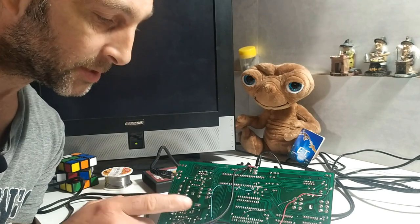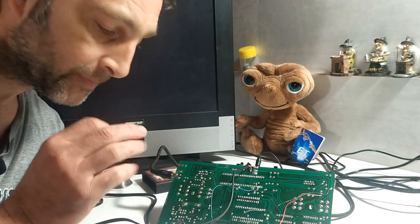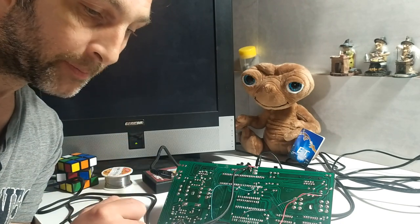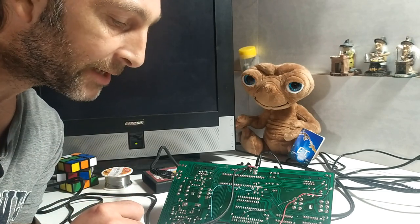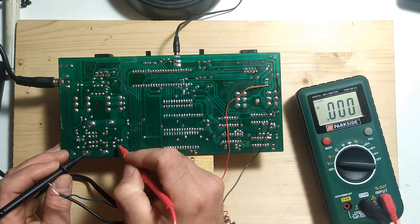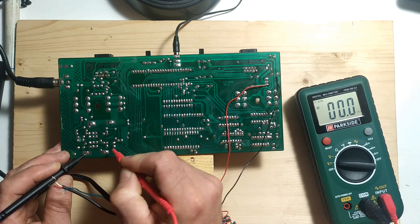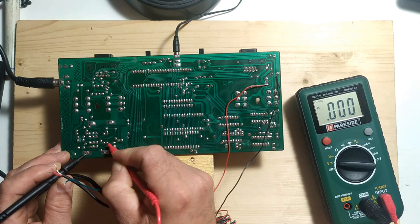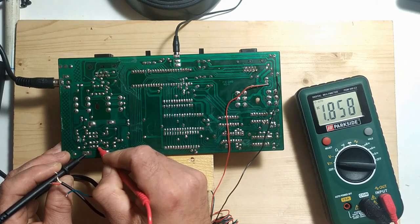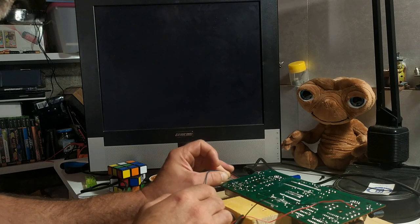Now all that was left to go from the TinyComp to the Atari was that little greenish blue turquoise wire that I had. And what I want to find for that is a composite signal, a weak composite signal that I can feed to the TinyComp to have it be amplified and fed out to the television. So the most logical place to look for a signal like that is down in the bottom left-hand corner here where we find the RF can. And I probed around with my multimeter looking for a low voltage signal that could potentially be a composite signal, and I found 3 points that were at 1.8 volt. Now, with everything turned on, the TV turned on, I just touched that bluish green wire to those points to see if I get a clear, crisp signal on screen.